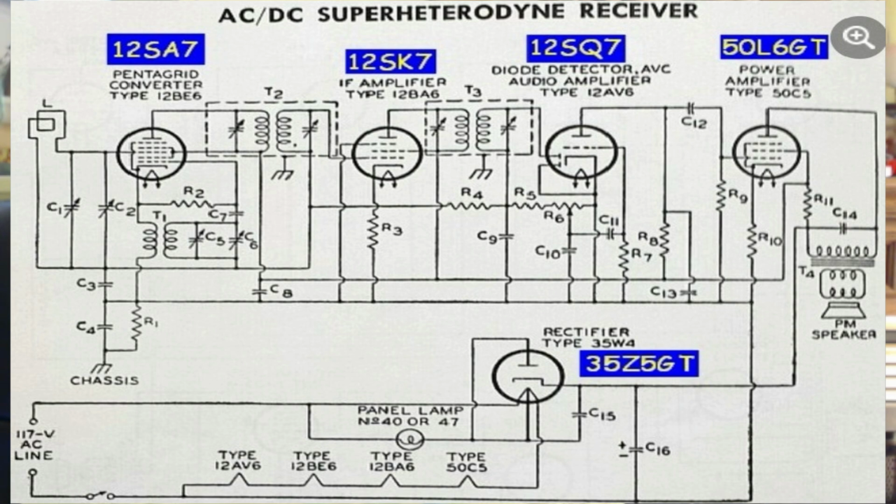In the case of the radio I'm looking at, it's 455 kilohertz. And by the way, the documentation says kilocycles, because that was what the unit was called in the 1940s. Okay, this first thing that looks kind of like a patchwork is really an inductor, and it also served as the antenna. Across it is, of course, one of the two ganged capacitors and another capacitor. That capacitor was a trimmer that could be adjusted with a screwdriver to bring the frequencies on.